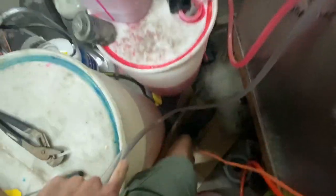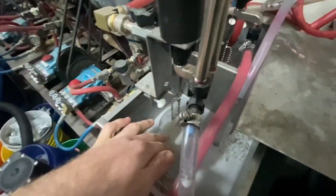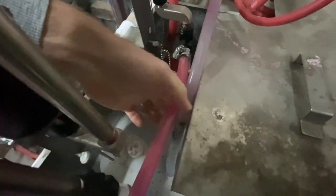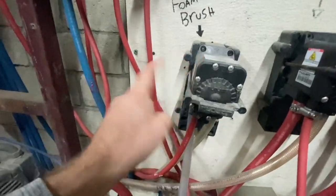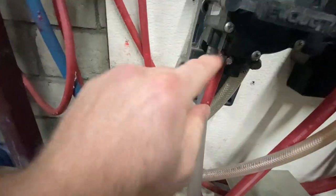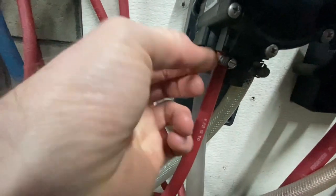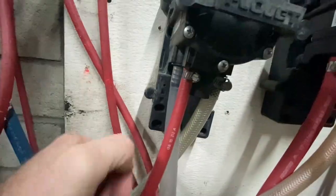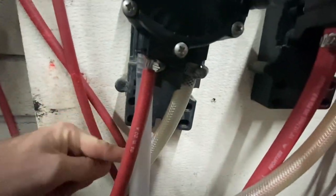So the soap from the barrel comes up through here, and then water comes out and it mixes in this tank. From this tank, it gets sucked up from this tube here — that tube's just sitting there. And that goes straight into the flow jet pump. Then from the flow jet pump we have the air — this is the air hose. If I take that out of the flow jet pump, the soap will stop coming out of the bays. There are three hoses going in, and this one comes in here, goes through the flow jet, and comes out of this one.